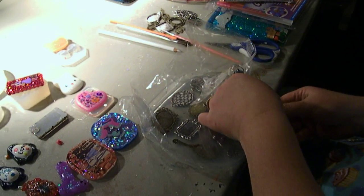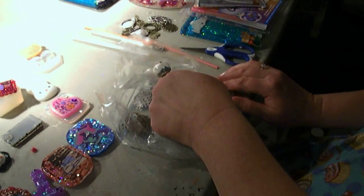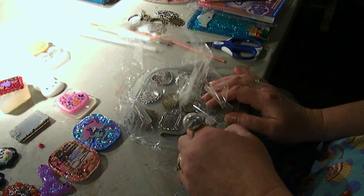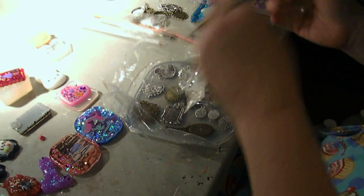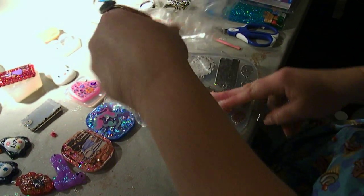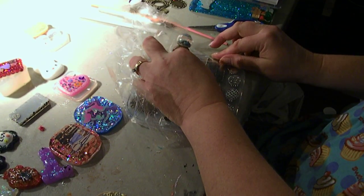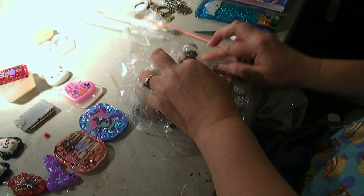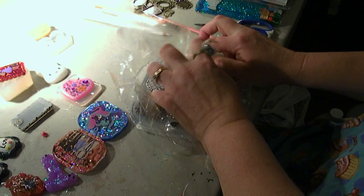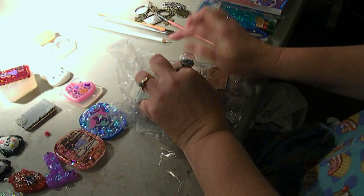I don't want this video to take up the whole time of me doing this. I have to say, demolding the other silicone comes off the tape much easier. Maybe I should have left it set longer. It's been 3 hours. It says it takes 3 hours, but you know, it doesn't hurt to let it sit longer either. So, if I just get the edges off, it seems to come off easier. So, just kind of pushing the edges down.